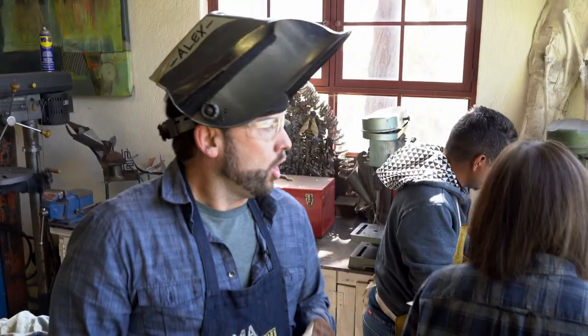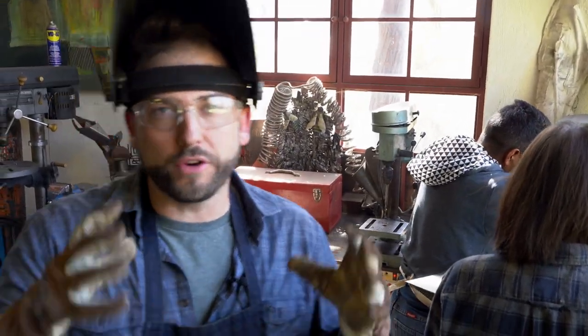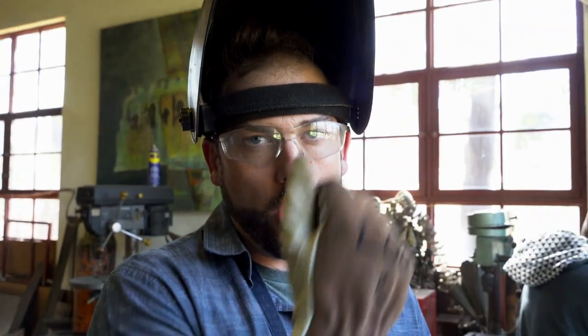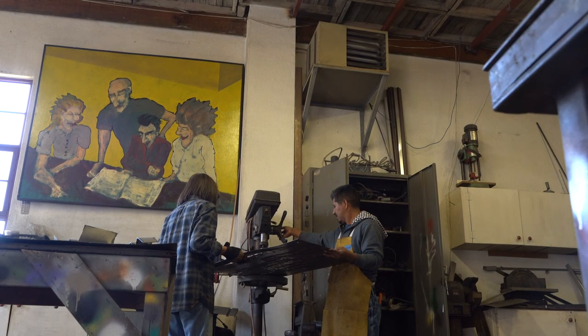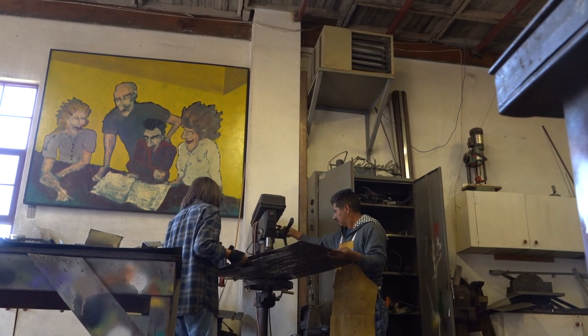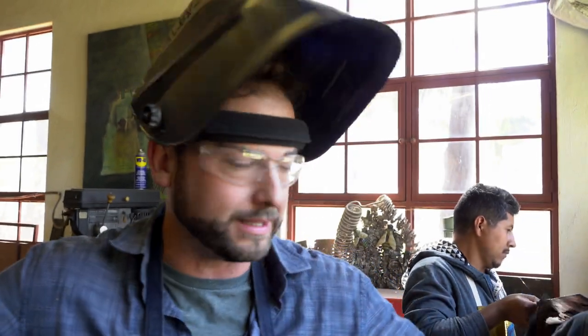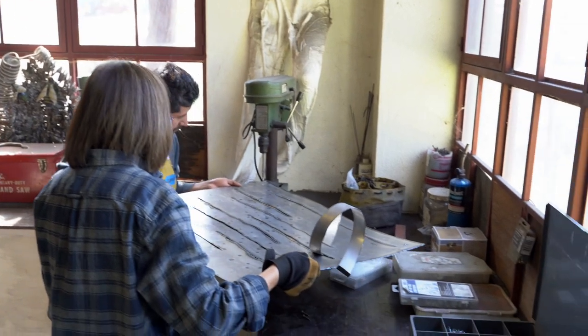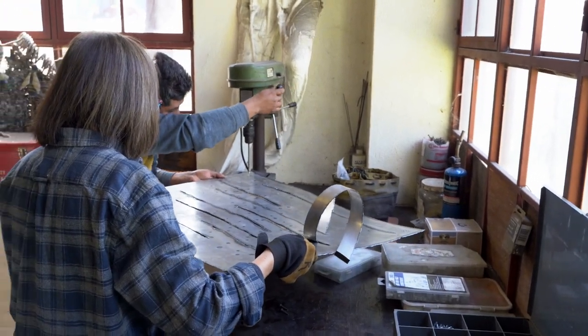Tip, right? When you're doing drill pressing, first of all, if you're holding a big piece, it's always good to have backup. You want to be on the wheel, not trying to hold the thing and be on the wheel. The reason why is, if something goes wrong, you want that other person to be able to switch it off and back you up with big pieces. See what they're doing? They've got a big wall piece they're working on in tandem.